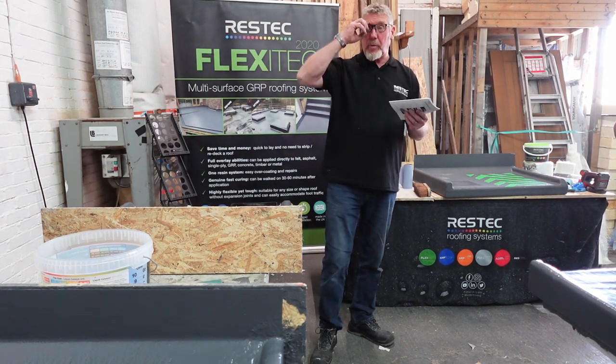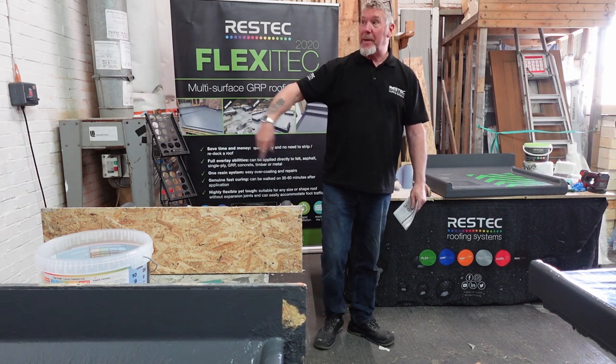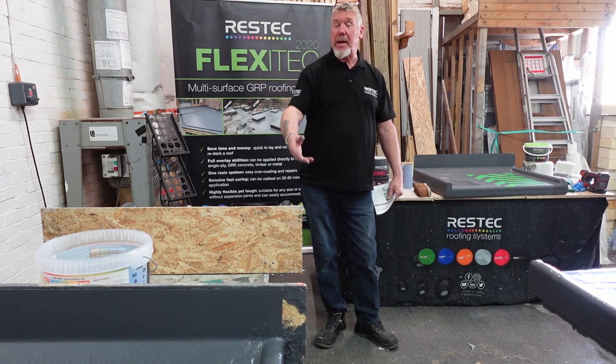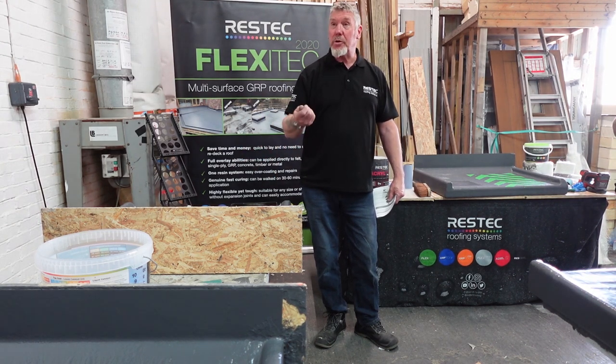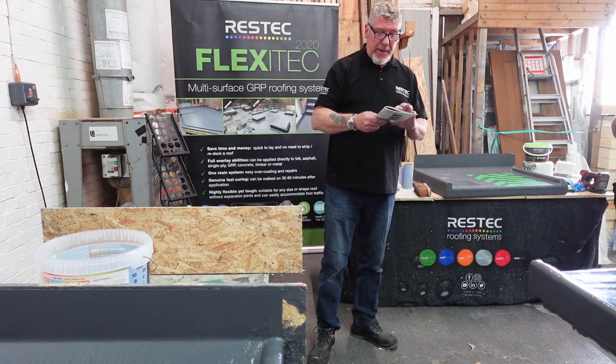Now you've all done this, you've all been out to sites, you've looked at flat roofs. What part is falling to pieces? It's around the perimeter, isn't it? There's condensation got underneath it. So if you actually paint it out, it just stops condensation attacking the timber. At the same time, paint the bottom edge of your trims, so you're not underneath, trimming it all in. Okay. Expansion joints.